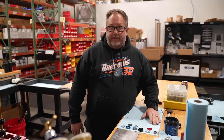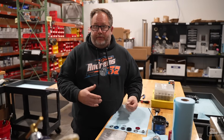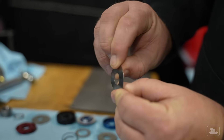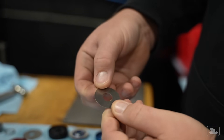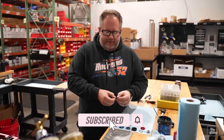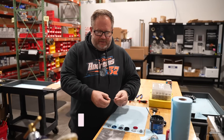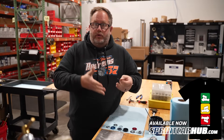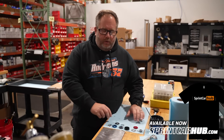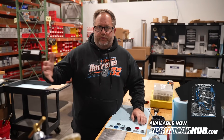When you hear somebody talk about the valving inside your shock, this is basically what it is. Pistons come in all types of shapes and sizes with different amounts of flow and different degrees of preload, along with shim stacks. CSI makes all of the parts other than the shims and seals — those use high-quality Sandvik material that's stamped and built for all the flexing it will see. These shims bend and open to let fluid bleed past the piston, and that's how you get the dampening curve of your shock — all these components building the actual valving to get a certain force on compression and rebound.